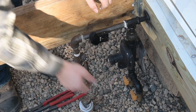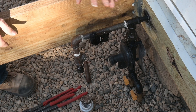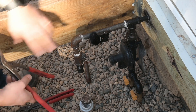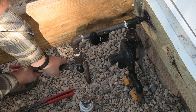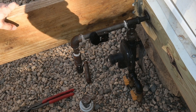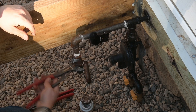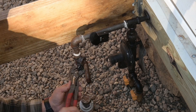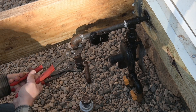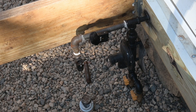Another thing you can do is go back to the fittings that have already been tightened, take off the excess pipe dope, and apply it to the next fitting. There's really no point in having a lot of excess sitting there, but you want a little bit extra while you're connecting it because you want it to be fully filling every one of your gaps between those threads. Since we are pulling against a very long piece of black iron — I know that this piece going into the house is about 10 feet long — I probably don't actually need to double wrench it. If I'm turning this fitting down here, is it going to be putting a lot of strain on any particular component? If we're just talking about it being this long piece of pipe going back, I'm not really concerned. But it moved the regulator a little bit right there, so I'm going to go ahead and double wrench now. We're going to just slightly under-rotate it — it's almost all the way there, but not quite.